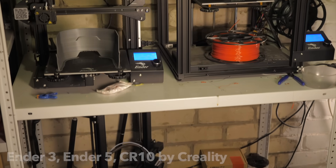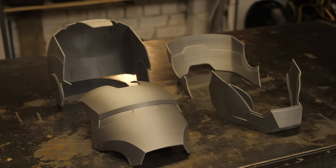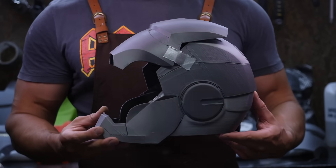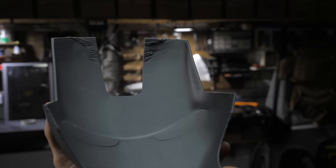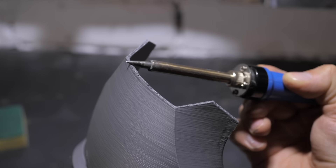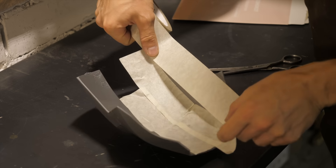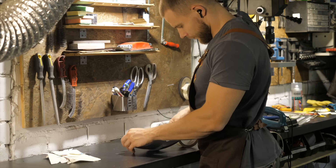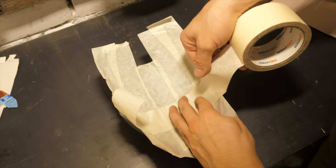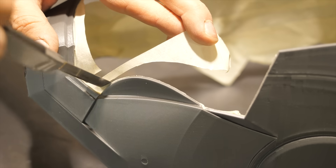In the meantime, while we were captivated by the strength-of-materials experiments, our 3D print farm working 7 days a week has already produced the first parts, so now we can move on to reinforcing them. First, align the edges and fix print defects. Then we begin making patterns for the parts — we make a paste from a couple of crossed layers of masking tape on the inside of the printed parts to get accurate templates, which we then transfer to the reinforcing materials.